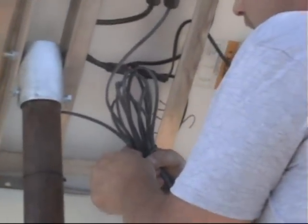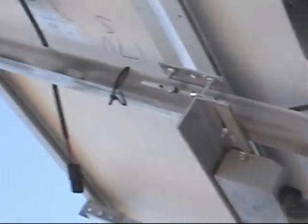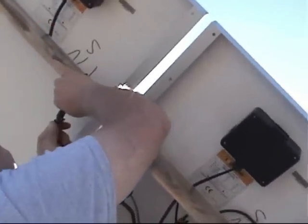We're rolling up our excess water sensor wire and attaching it up under the panel. When you purchase your system from Robison Solar Systems, each will come with approximately a foot and a half to two foot lead of wire in place and a wiring harness to tie them all together. You'll need to take your wiring harness and make your connection. In this application, we have three panels all in one mounting structure, so we have three connections to make to tie the panels together.